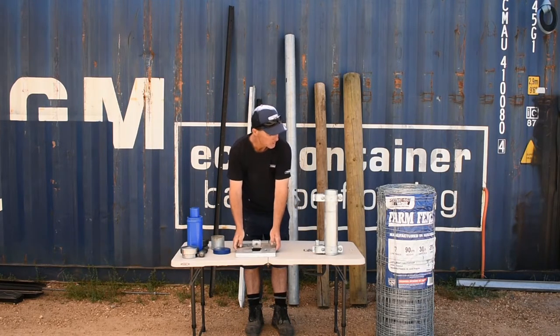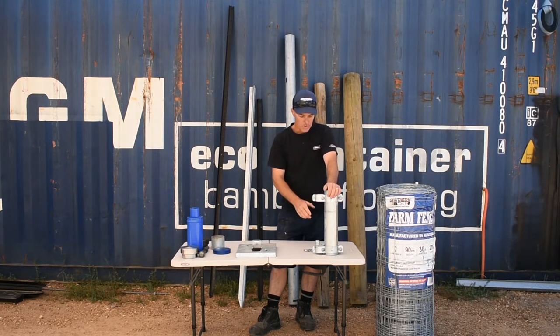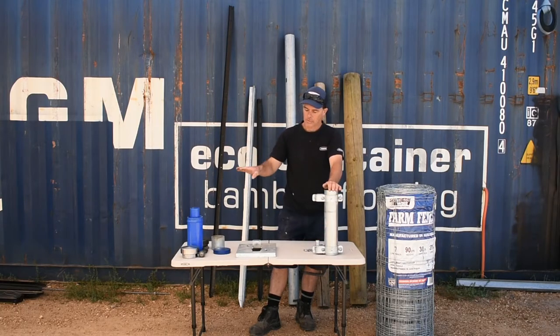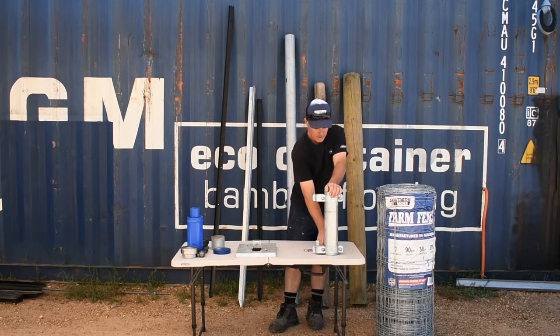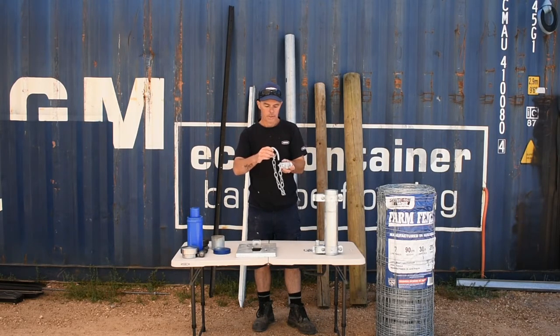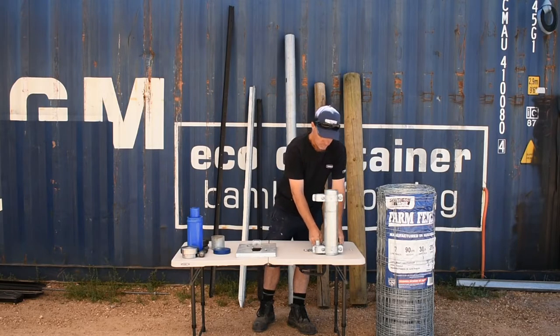The beauty of the steel post is these gate assemblies — they're all prefabricated, very strong, and adjustable. The bottom where the gate sits is adjustable backwards and forwards to help you align the gate. It can also be tech-screwed through these holes for extra strength. The latch attaches to the gate, goes around the post and clips in. There are various other options available as well — pretty straightforward stuff.